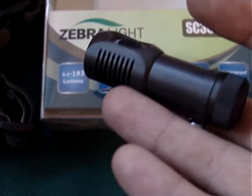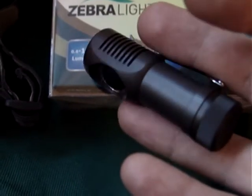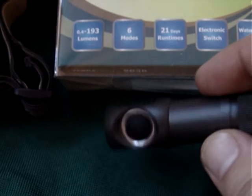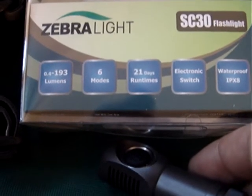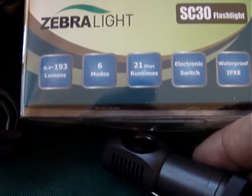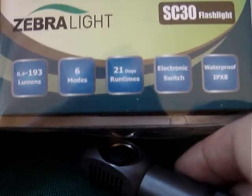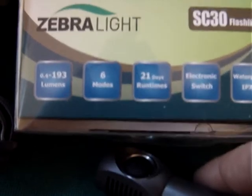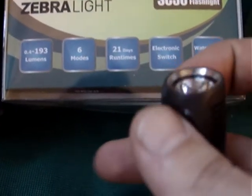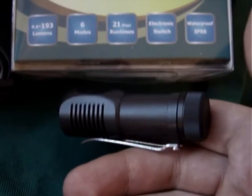When I'm outdoors, especially in cold weather, I prefer using CR123 batteries or lithiums instead of nickel metal hydride AAs or rechargeables because they just light up and last a lot longer in the cold. Run times drop significantly, especially when it's below zero or even below 5 degrees C. You can get up to 50% or even more drop in output from your electronic equipment depending on the temperature.